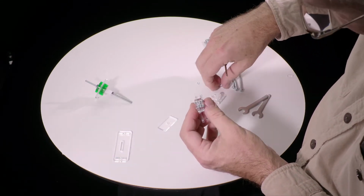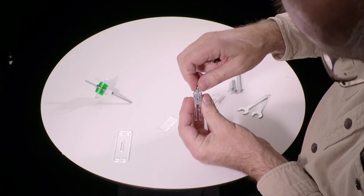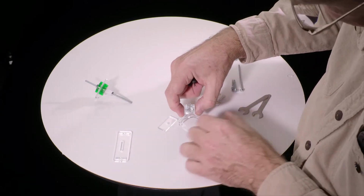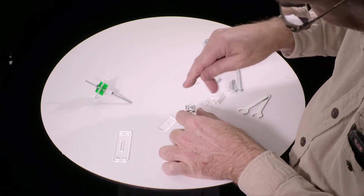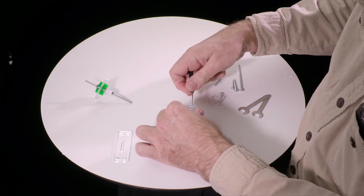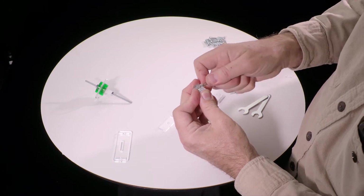And you can take any one of these other screws here, temporarily thread it into the nut, just as a way of checking that it's properly centered. And then take that screw back out again. So now we're ready to tighten it. So we want to set it down on a flat surface. And that will get these things aligned with each other so they're both parallel. And then we want to sort of press down this piece in the middle. It shouldn't be sticking up at all. And then you can tighten it. So you don't really need a wrench on the other side because the nut's pretty well bind. And sort of tighten it alternately a few times so that they're both evenly tight.